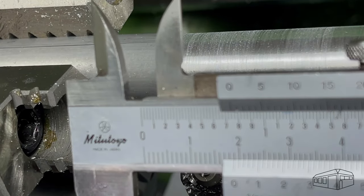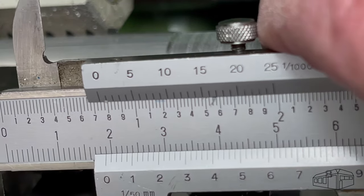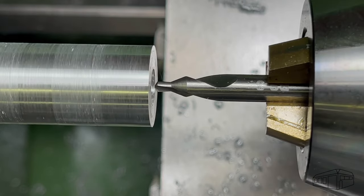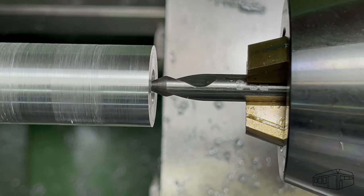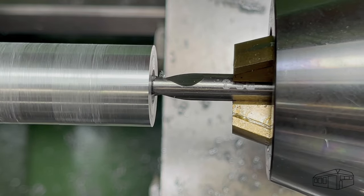The original pulley setup had three step pulleys. I'm only going to use two, a driver and a driven, which means I can now use the idler hole for mounting for the tachometer sensor. I'll machine a 19mm stub shaft with an 8mm threaded hole, then I'll make a small bracket to hold the sensor.